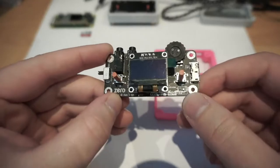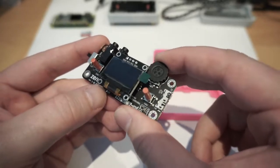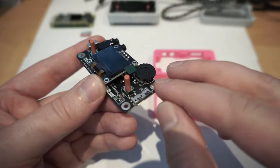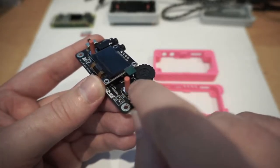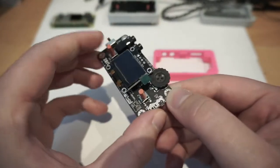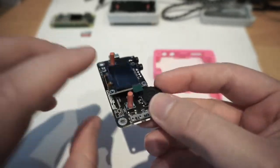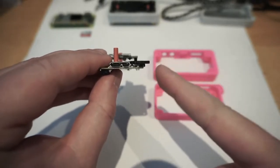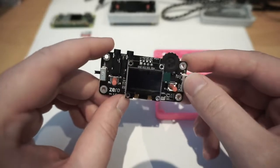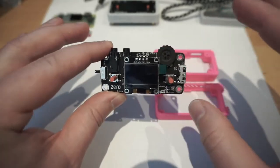So here's the PCB, and what you'll notice is that there's this surface-mounted wheel here, which is one of the key highlights of this board. It's a really nice click wheel with button functionality. It's a surface-mount device, which means it's only attached on the top of the PCB. There are four signal points and two anchor points, one on each side. It is fairly secure under normal use and has two pegs that stop it moving backwards and forwards, but if you apply any force in the upwards direction, it is possible to rip this wheel off the board. So be very careful when installing and removing this board from the case, as these boards are in very limited supply.